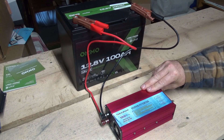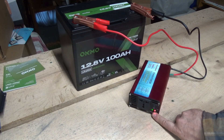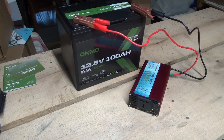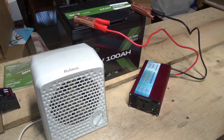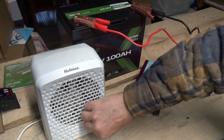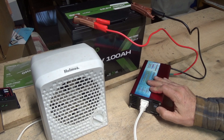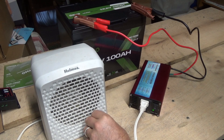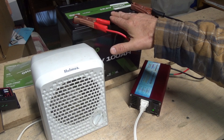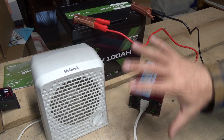So this was on. The next thing is very simply turn on your power inverter and now I'm going to hook up a load. Right here I have a fan — just an AC powered fan — and I'm going to plug it into our power inverter. Turn off your inverter, plug in your device that you want to run, then turn on your power inverter, and then you can turn on your fan. And there we have it — we're powering a device off this battery. It's that easy to set up a portable power bank in your own home.